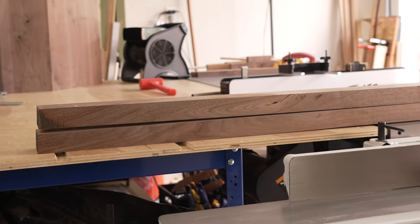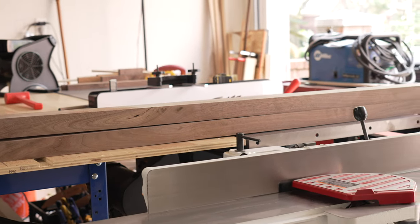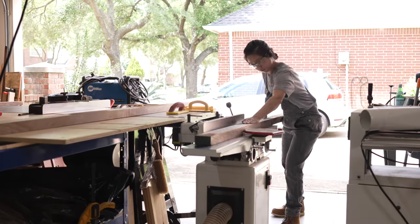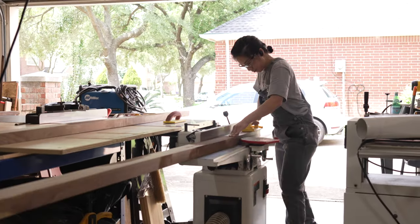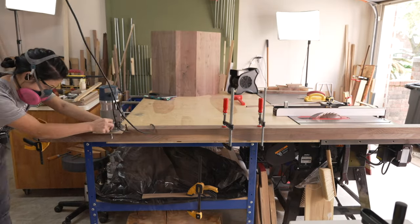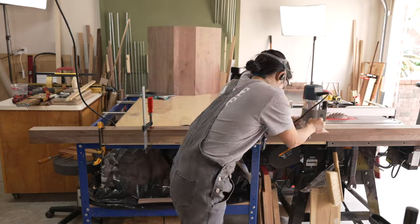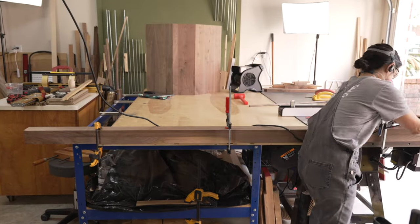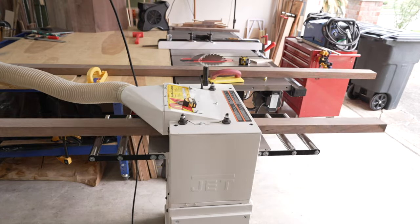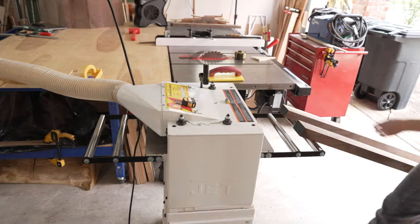One of the boards had crooked, meaning its edge had warped. No matter what you do to prevent these situations, some boards will still warp from time to time, and it becomes a matter of knowing how to deal with it. Since I still had wiggle room from cutting little by little, I used a straight board to establish an edge and flush trim the crooked one. With their widths now narrower than 6 inches, I proceeded to join and plane them like normal.